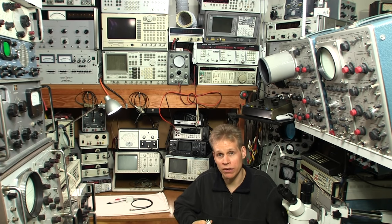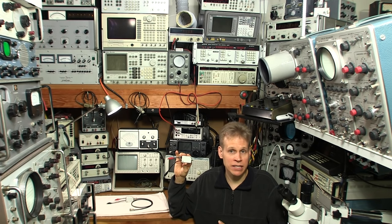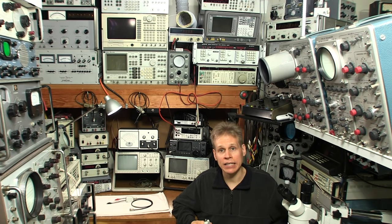I work on a lot of high voltage gear — vacuum tube gear. The rough high voltage in an everyday vacuum tube receiver with a transformer would be around 300 volts DC, called the B+. The last thing I want to do is feed that into my spectrum analyzer or tracking generator output. These little boxes are designed to block DC and very lightly couple my spectrum analyzer into what I'm aligning. I'll get into more of that at the whiteboard.